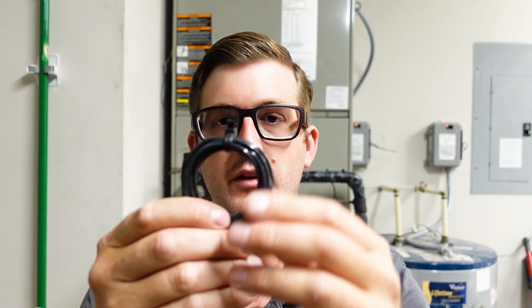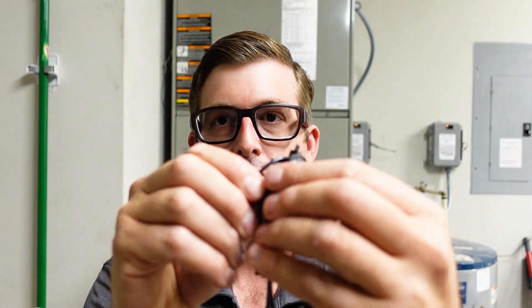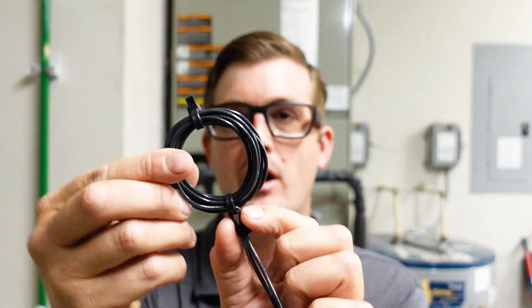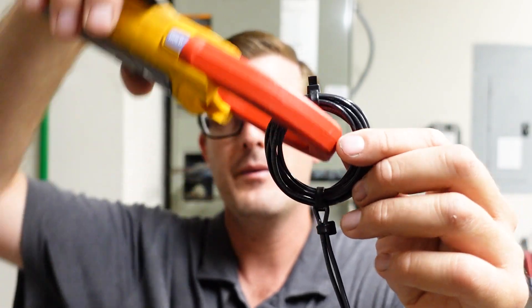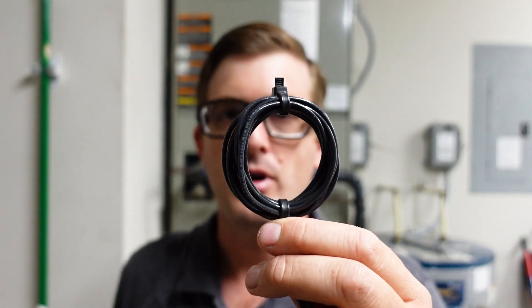It is simply a length of wire that we've wrapped around to make 10 individual strands at any point that I can put an amp clamp on this ring of wire. So anywhere I count it on here, except for obviously the bottom where they overlap, is going to be 10 pieces of wire. I can put my clamp reader on anywhere around this circle and get the proper reading.